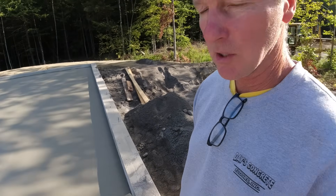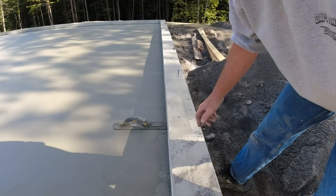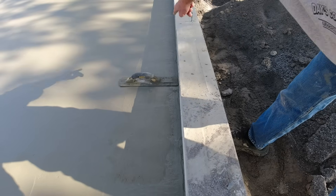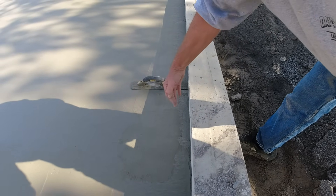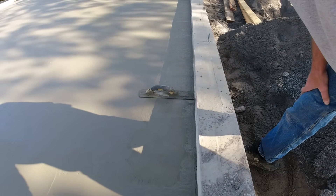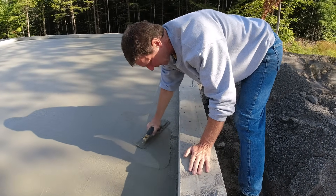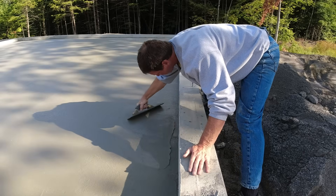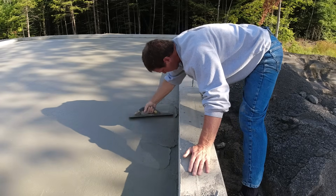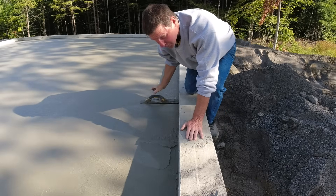I can do the front where I have the garage door tip-downs from outside, and these two sides — it just makes finishing a lot easier. See where I hit it with the mag float? There's a tiny little piece that's not hitting quite right. I want to go all the way around and fill that in. If it tips down just a little bit I want to fill all that in and any other little imperfections — it's going to make it look a lot nicer in the long run.